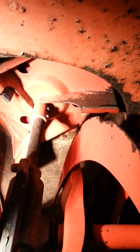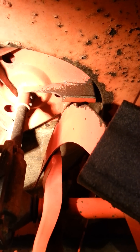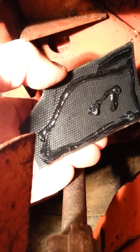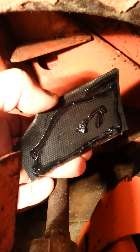To prepare for the next impeller, move the blade forward with your hand to about this position under the auger. You can see this is very rusty, so I'll be cleaning it with a sanding pad before using the Gorilla Glue. Now I have a clean surface — I'll put on the Gorilla-glue-treated rubber pad. You can see I cut a corner to make it fit a little bit better.